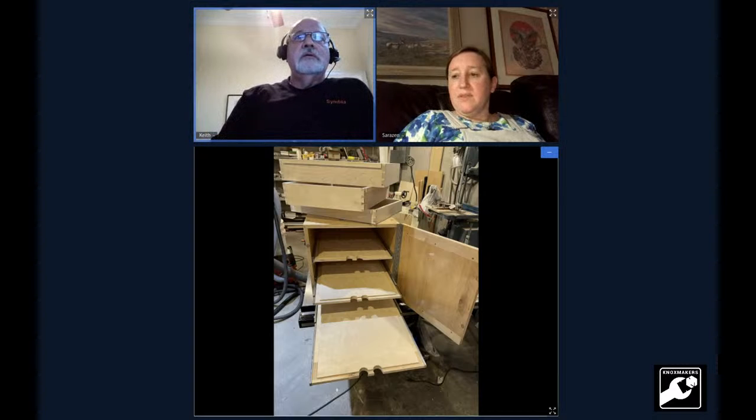This is a detail of the joint I used to make the box. It's not a lock miter exactly, but — if you make butt joints on plywood you can see the laminations, which I didn't want. Also a butt joint on plywood is not the strongest joint. This kind of combines a miter joint where you cut 45 degrees. Miter joints are nice because they hide the laminations, but they're a little tricky to glue up because they just tend to slip.